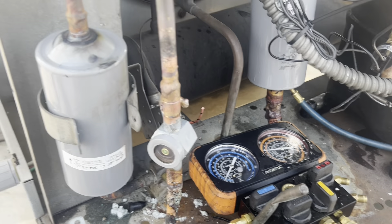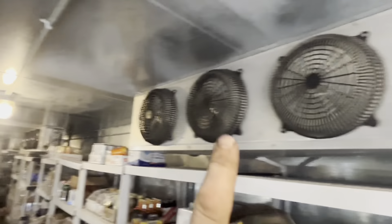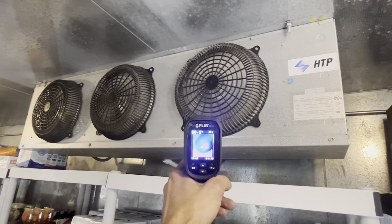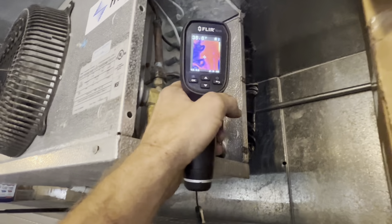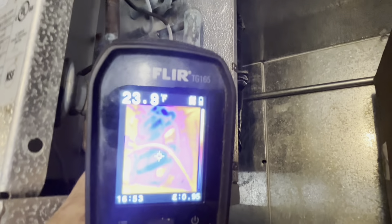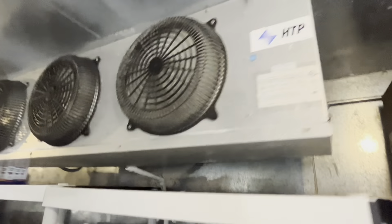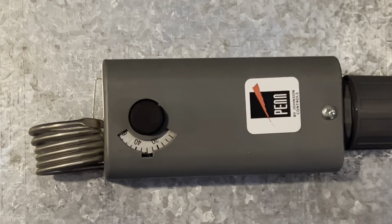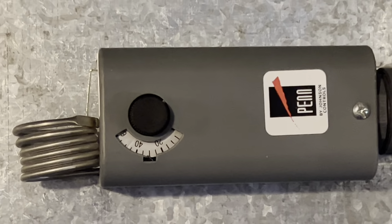Go inside and check the evaporator. All right, these are our buddies - these two evaporators. Oh, we're frosty now! The 25-degree coil is about right. There it is. 35. I'm going to bump it down a little bit.